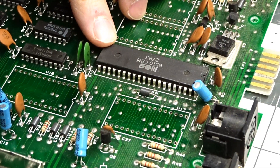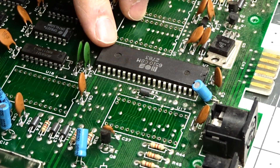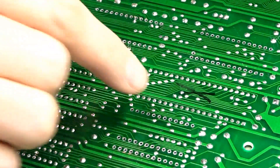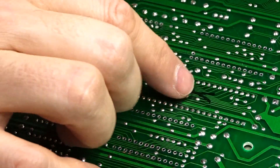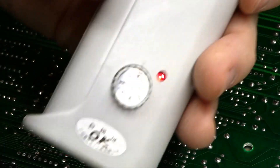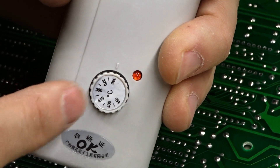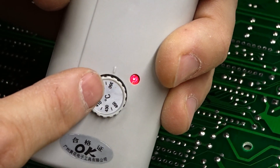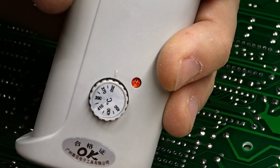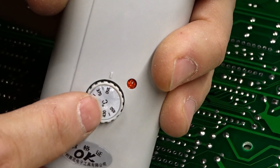This is the chip I'm going to be removing — the MOS 6510, the 6502-type CPU on the Commodore 64. To get this chip off we're going to flip the board over. Since the back is a sea of green, I like to take a Sharpie and draw an X in the middle of the chip I'm going to be removing, so I don't accidentally remove adjacent pins. Next, I'm going to take my desoldering iron and set it for 350 degrees. If you're going to do large ground planes you need more heat, but for thin traces on a single or double-layer DIP board, go as low as you can — 350 is about the minimum on this unit.